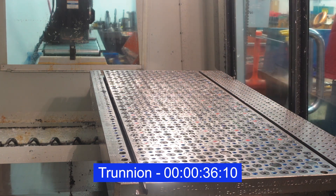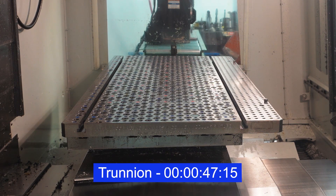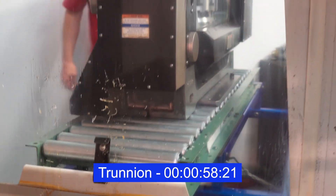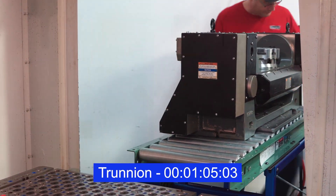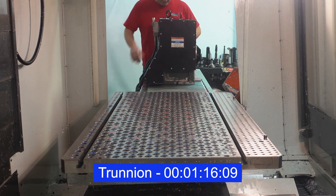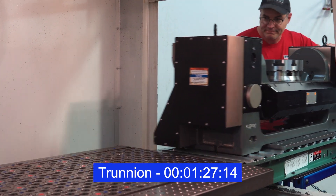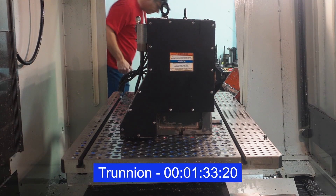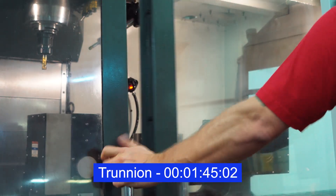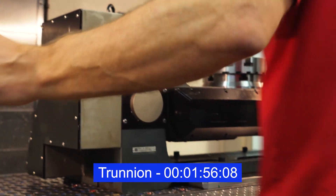They're nice to have in the fixture at all times so that we're not running around the shop looking for our dowel pins. They also facilitate what is about to happen with the trunnion — we're going to slide a plate across that table. And then instead of trying to drop dowels from the top, we're going to raise the zerts, the retractable dowels, up into the fixture plate. So you can slide that plate right across with no obstructions. This is our niche in the world — we are making fixturing in which there are no obstructions to the machining or the installation of our tooling, parts, whatever it is that we're doing. We already have a video regarding the roller cart he's using there — our trunnion lives on that cart, that's its home. We don't have to worry about picking it up and dropping it off.